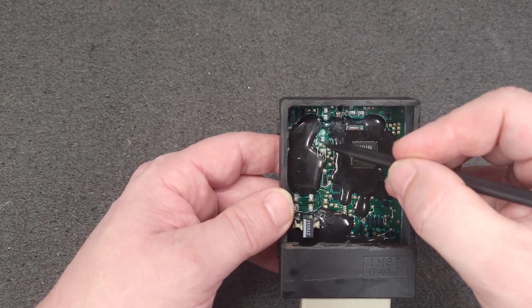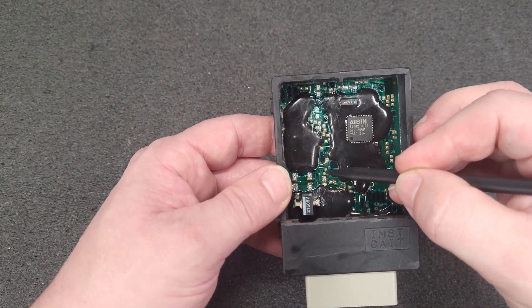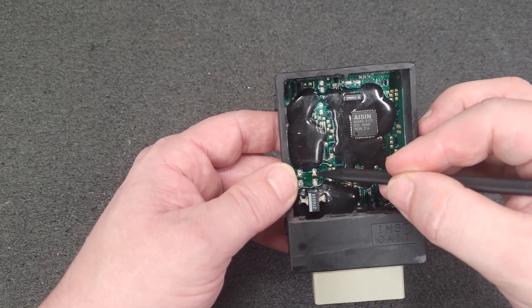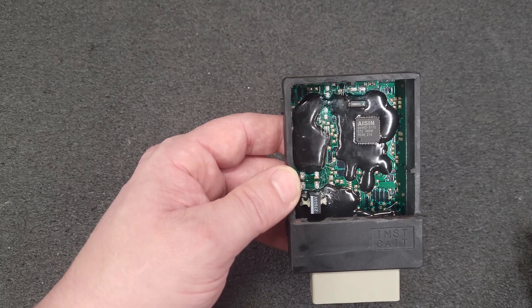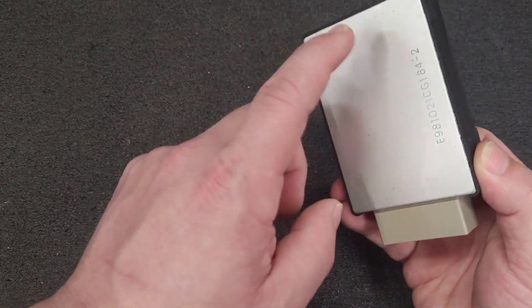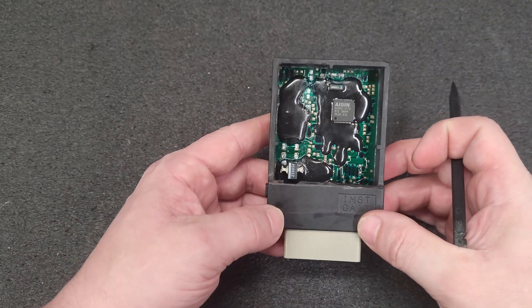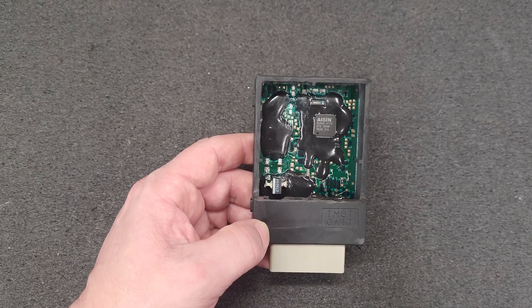Chipping away at the epoxy, it wants to take the conformal coating with it, so I did put some new conformal coating down. Be very careful of the bonding wires — I did break one, but it goes to the pad of that capacitor so I will do a new jumper on that one. You're going to have to heat it from the bottom to about 200°C. I'll cut back when I get the capacitors all soldered.